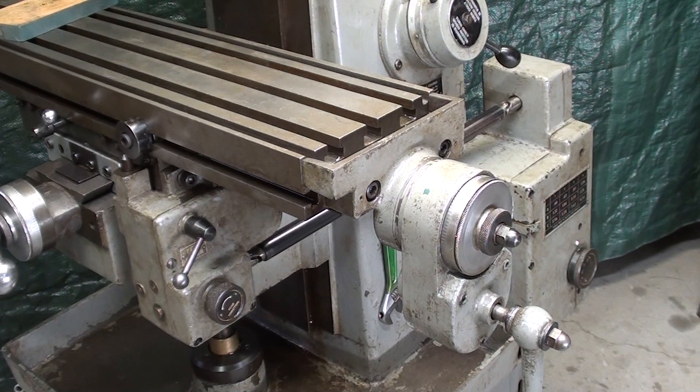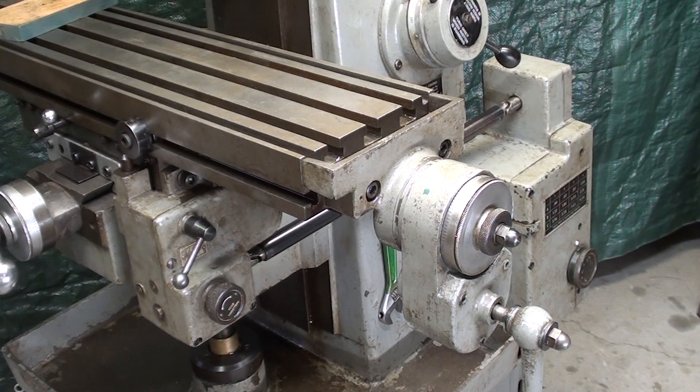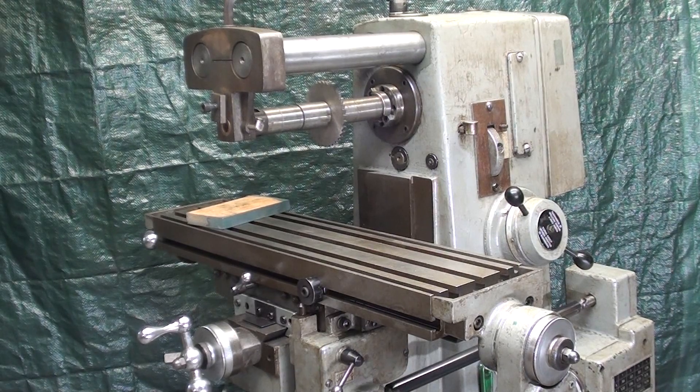Now looking at it from this angle, again here's the main gearbox back here. The drive shaft comes into another gearbox here that is called the reverse feed gearbox — I had that apart, you saw that in one of the previous videos. There are two controls here: the lever here is the table feed lever, meaning that turns the feed on and off, and then we have a knob here that is the feed direction hand wheel, so that would change it from feeding left to right to the other direction, right to left. You're going to find that regardless of the manufacturer, a knee type of horizontal milling machine is pretty much the same. Some controls are going to be in different positions, and the larger machines are going to have power feeds in both the X, Y, and Z directions. This is a smaller one, so we only have it in one direction.